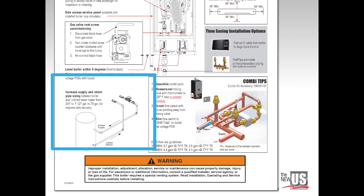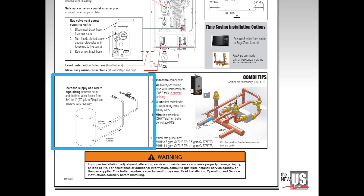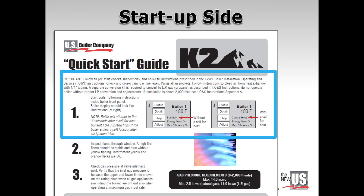It's always a good idea to increase boiler pipe sizing between the boiler and indirect tank to one-inch diameter piping. After your mounting, piping, venting, fuel, and electrical connections are perfect and air is purged, you are ready to commission the boiler.